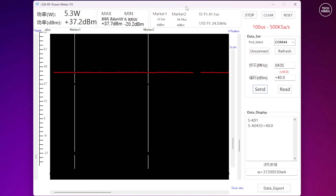I'll use a V5 RF power meter and software application to check power output. The radio is rated at 6 watts for both bands. On the 70-centimeter band at 435 MHz, the power meter reads around 5.5 watts. On the 2-meter band at 145 MHz, we see around 5.8 watts. Given the tolerances of the 40 dB attenuator and power meter, that's pretty close to the specified output power.